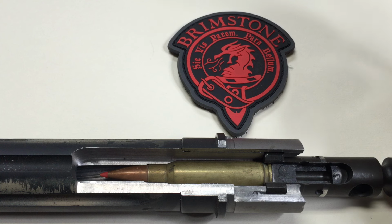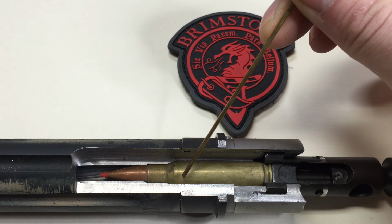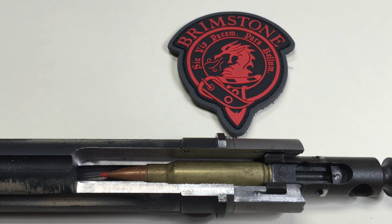Some issues that we run into with this: we had a guy we built a rifle for, and we set a nice tight match chamber, and then he was hand loading and he was resizing the brass very radically. He was resizing it as much as he could given those dies, squeezing the brass back and setting the shoulder back a significant distance. And so when he was shooting it, his brass was looking all weird. It was starting to stretch. He was getting signs of excessive headspace. And so he brought it back saying, hey, you guys got this chamber too loose. And we showed him with our gauges how it was a perfectly tight matched chamber. And then through the discussion, we eventually were able to show him how he was reloading it and resizing the brass too much. So he was getting the signs of excessive headspace in his chamber, but it was because he was resizing the brass too much.